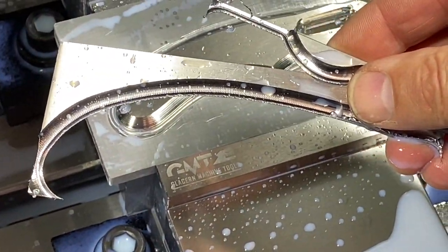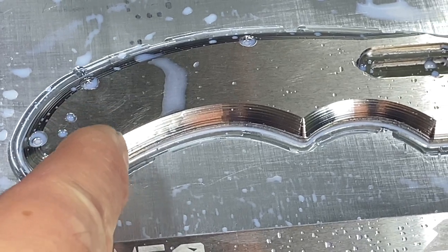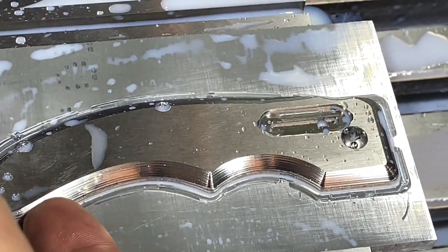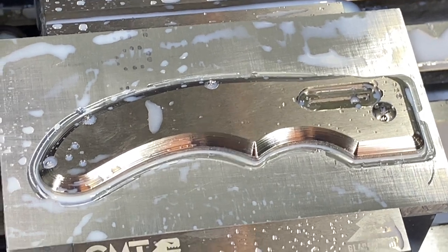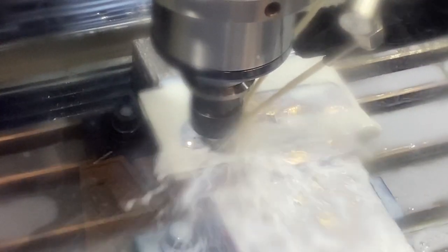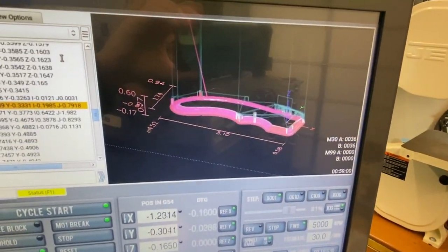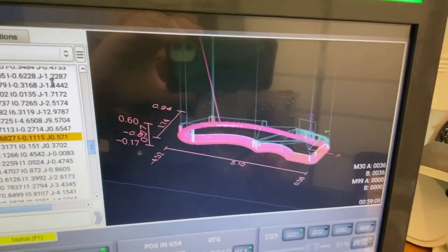We didn't use tabs and we cleanly got rid of those pieces — that worked well. We've got nicely profiled contours with pretty even steps, so the finish cut should be taking a pretty even 10 thou off. Our contour is done, beveled on the bottom side, and now this long last cut goes around to clean everything up. The final pass is cruising at 30 inches per minute, and after an hour of machining it'll take about another 26 minutes to finish this piece.